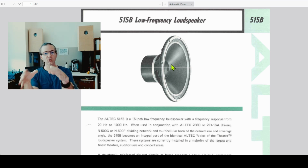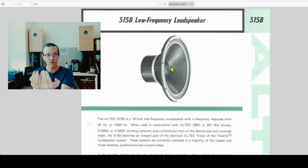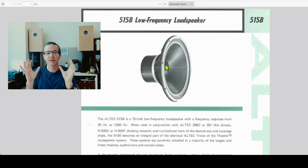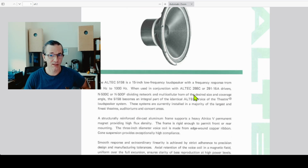So we have a dome loudspeaker basically that's moving back and forth and creating sound, and that's the point where it meets the cone itself. So the cone driver meets the dome driver, and the differences between how these work with each other, when the frequency reaches that wavelength that corresponds to the diameter of the dome where the transition is happening, that's where the cone breakup modes are happening. And this gives a very strong coloration to the sound, and that is very much audible.